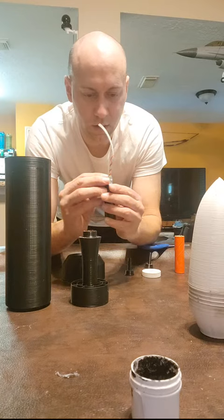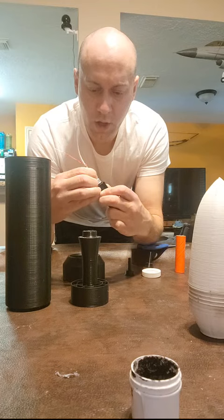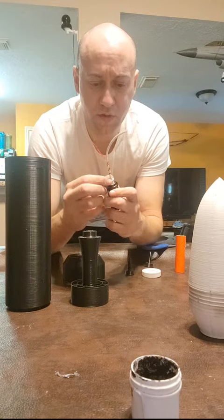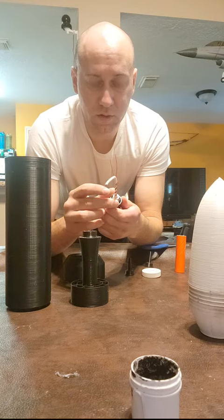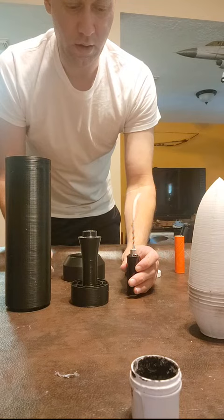The nice thing about this HVAC tape is, since it's aluminum, it combusts very readily in the exhaust of the rocket. So as soon as the rocket is ignited, and this is in milliseconds, it'll build case pressure, but then it'll light the quick burning fuse and burn away the HVAC foil before the case pressure becomes critical enough to cause damage to the rocket motor. This will all result in a quicker combustion cycle for the engine.